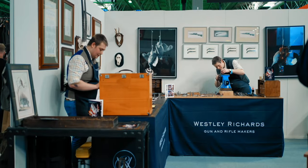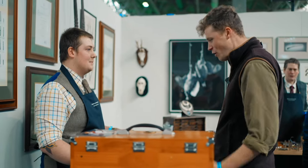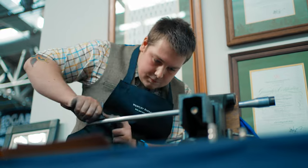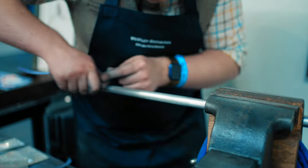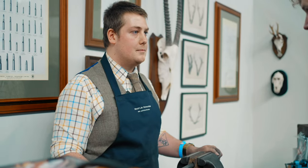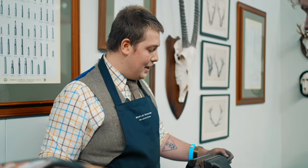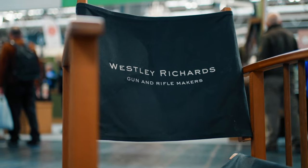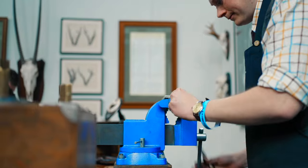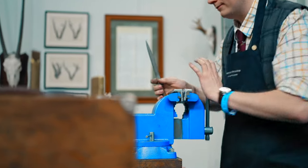Lord D is on the Wesley Richards stand, polishing a barrel — going from 150 grit up to 2,000 grit on an old military 303 Wesley Richards, a three-day job due to hard and soft spots in the steel. They're making it like a brand new Wesley Richards. Wesley Richards is also looking for apprentices: the program starts with six to eight months making your own tools and toolkit, then you rotate around the workshop to find where your skills fit best — stocking or metalworking — before rising through the ranks.